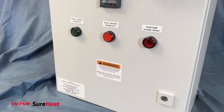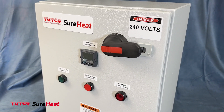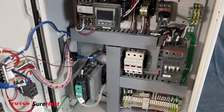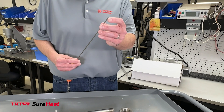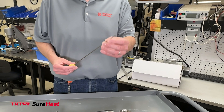To control things properly, your controls need to react fast, making small adjustments to the voltage applied. This method keeps the heater temperature stable, typically within plus or minus two degrees. Thermocouples are the key to control. A type K exposed tip thermocouple is best — it's fast and accurate.